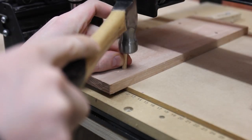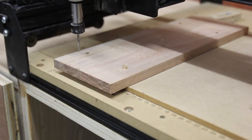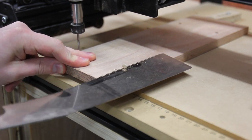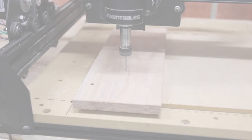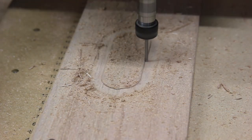After the four holes were drilled I added the dowels, flush trimmed them and went back into Easel. Here is where the errors started. The dowels were supposedly 6mm but they varied in diameter from 5.5mm up to about 7mm. The lesson learned here was not to trust store-bought dowels and instead make them myself.